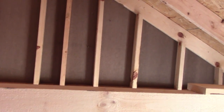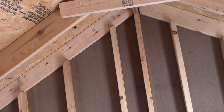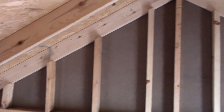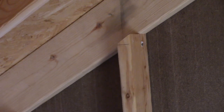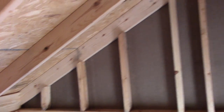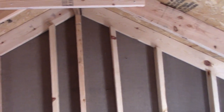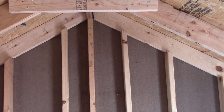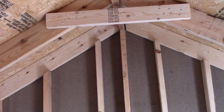You can see the boards going across there — my collar ties. On the end there, I've got to take a two-by-four, run it down that way sideways, and nail it into those little studs there so that I have a nailer for my ceiling material. And once I do that — get those boards in place — then I'll be able to nail something across the gable end there to follow along these lines of the collar ties. But that's what collar ties are and that's how I'm using them.